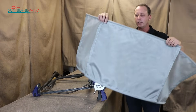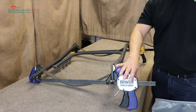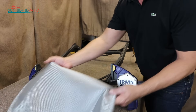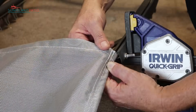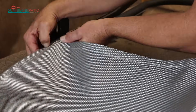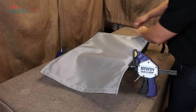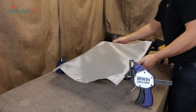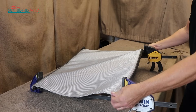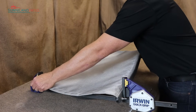Our slings are in — now let's get them installed. Let's put the back onto the bench and work on it since we already have the clamps on. If you need to squeeze them a little tighter — we're going to feed that spline into each side. Just twist it and get it started into that edge, and on the other side the same thing — get it started in there and then pull it up into the rail. Sometimes it gets a little stiff, but we're having a smooth time on this one. Don't over-tighten those clamps so they don't make the frame bend and stay bent.